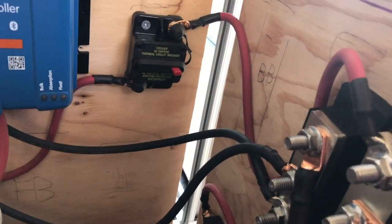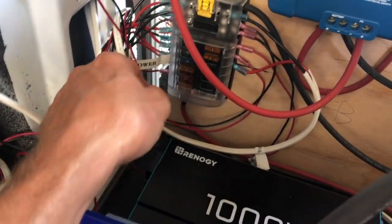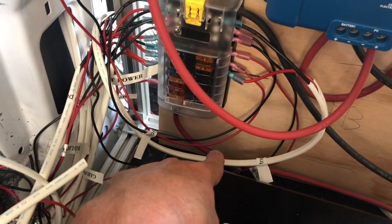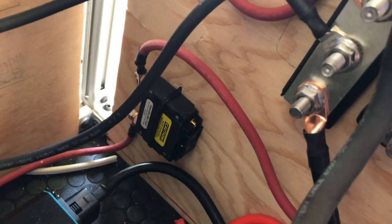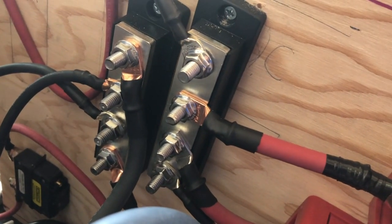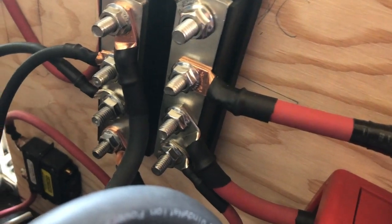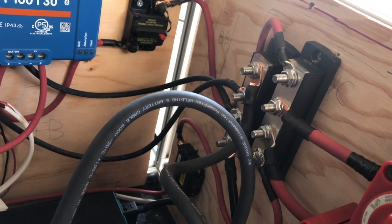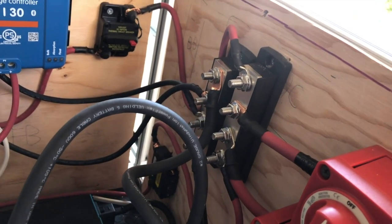As for the load side, here's my circuit breaker. At the top here is the negative lead for the circuit breaker — follow that all the way over and it hooks back into the bus bar, which is the common point for all the negative. The positive wire follows all the way down here and connects to another circuit breaker so we can disconnect power to the load side. The load side then connects into the positive bus bar. So there's only one connection for the whole battery on the positive side — one lead from the bus bar to the battery. Every other positive and negative lead connects to the bus bar, which simplifies the wiring and keeps everything clean.